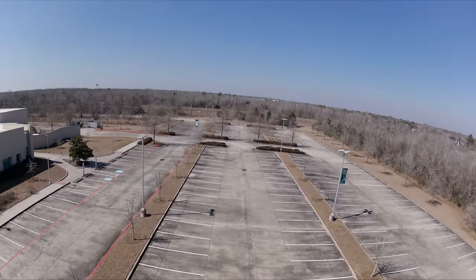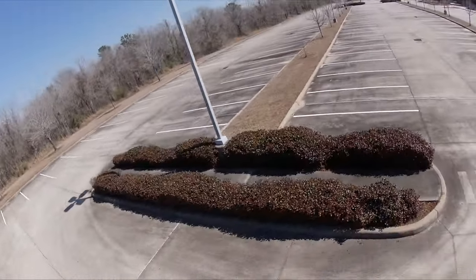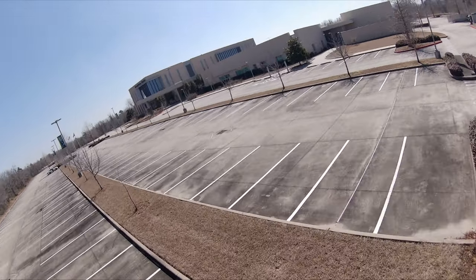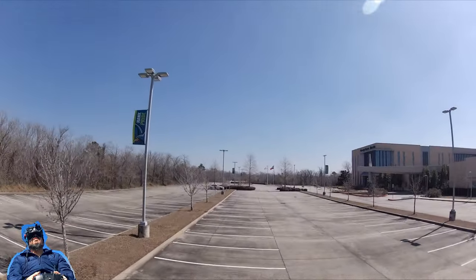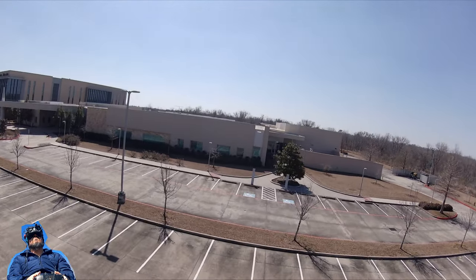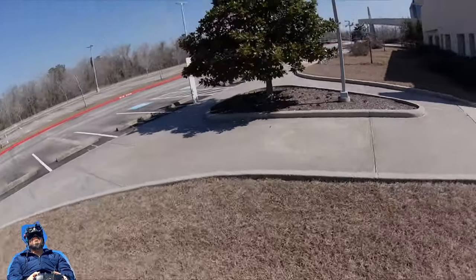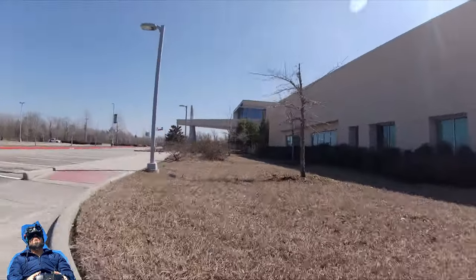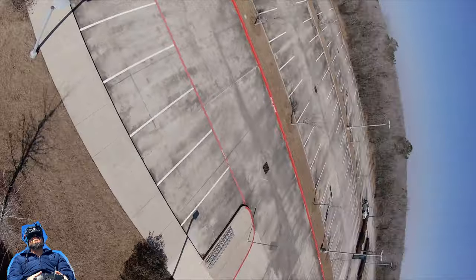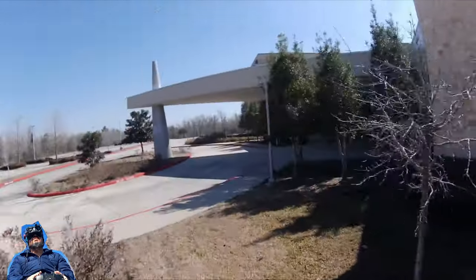This really just reduces your power across the entire range. Sometimes when you put a throttle cut, it cuts the top off, but your bottom is still really, really punchy. And that's what people kind of don't want when they're learning. You want to be able to have control in the middle stick range, because people have not really mastered that fine stick movement.